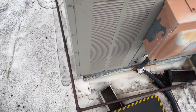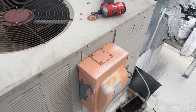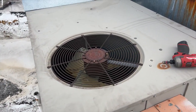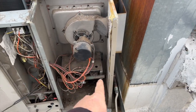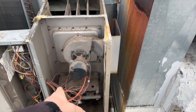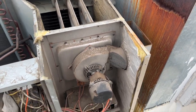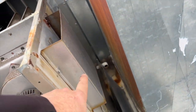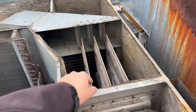We're back and we've got our heat exchanger over there. We're going to take this all completely apart again - just so you know, this unit has been off since I left. We're going to assemble this thing and get the heat exchanger swapped out. We got the lid off, we're going to disconnect the gas line, get the burner assembly out, disassemble the inducer, and get this thing out. There are screws all along the sides, so getting these is going to be a pain. Once I get this out I'm going to try to clean that coil a little bit better.